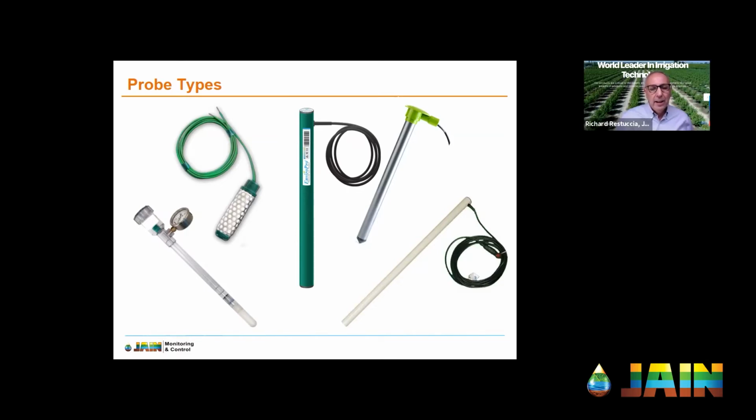Yeah. And then the other thing I wondered about those two types is, can we see anything else about the soil? Can we learn about soil temperature, salinity, or fertilizer from these two types of soil moisture sensors? Yeah, unfortunately, that's another limitation of these devices. We learned about the limitation that they're a single point. The second limitation is that the gypsum will degrade, and the tensiometer requires regular maintenance. It has to have water continually added to it, or else it breaks the adhesion to the soil. And then they just do soil moisture. They don't do temperature or anything else. But thankfully, these aren't the only two options that we have available to us as part of our offering.